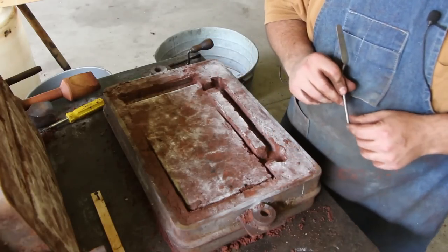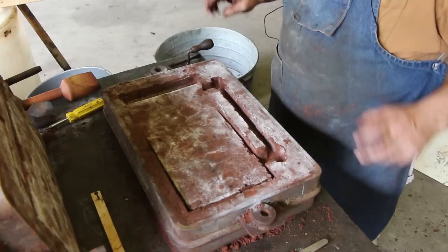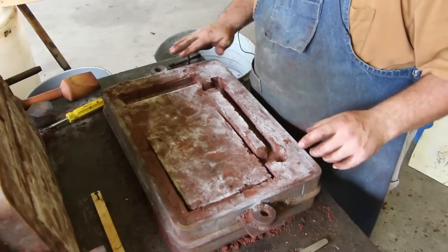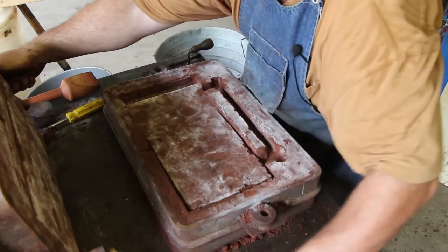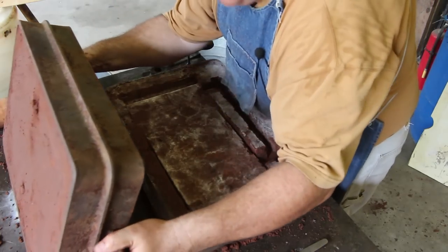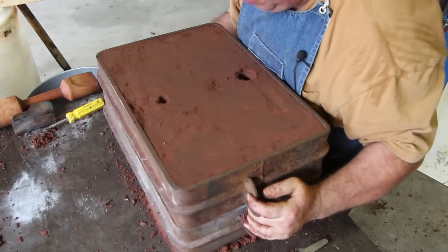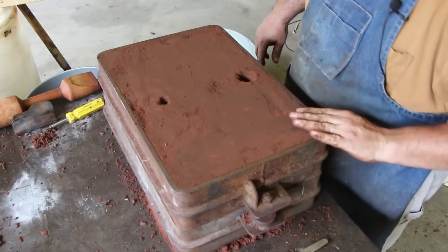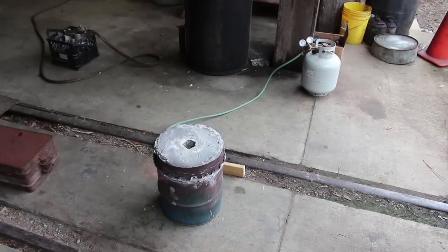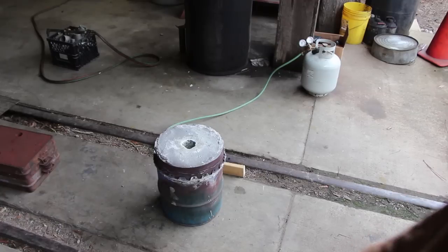It's not the prettiest mold I've ever seen, but I think it's going to work. It's just difficult to get a cast iron part out of a mold, particularly like this. A wooden pattern would be much easier to deal with. But this is ready to go back together. So let's put the cope back on and we'll set this aside and have it ready to pour. We have the furnace all charged up with aluminum now and got it fired up. Usually aluminum takes about 20 to 30 minutes to melt in my furnace, so we should be pouring pretty soon.